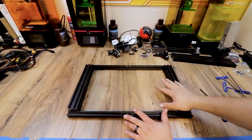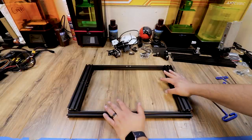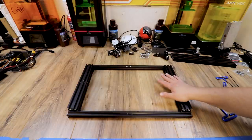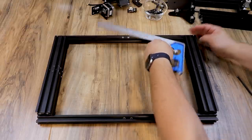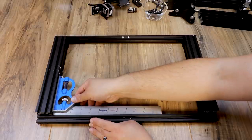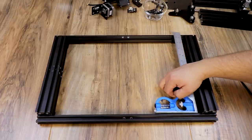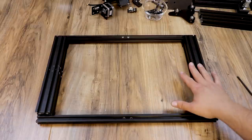I have it all connected now but not tightened yet. Make sure everything is straight and sitting on a nice level table — you want to do this before finishing tightening so it's straight from the foundation up. Grab a square and go in to make sure you are square on all four corners. Make sure you're totally square — you can use a corner square or any kind of square you have to make sure the frame is completely square before proceeding. Once you know you're completely square, tighten those bolts all the way around and move on to the next step.